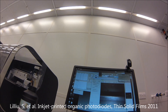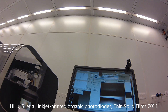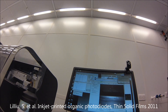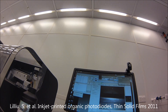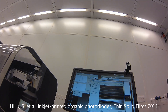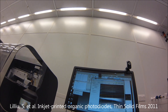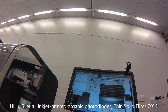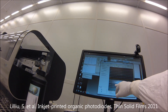This is called the 'calibrate nozzle' view. You go to nozzle 1, right-click, and set it, then do 'next' and it says go to nozzle 16. This is another reason why we set the angle to zero — if the angle is not zero you will see an offset. Now it's aligned. If I remove movie mode and set to 100, our target is to have all drops still, and the drop speed should be between 600 and 1000 — that's the optimal range.